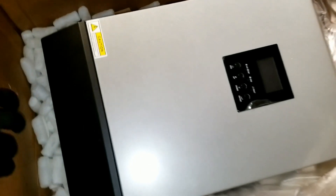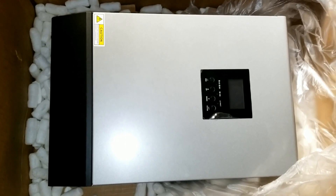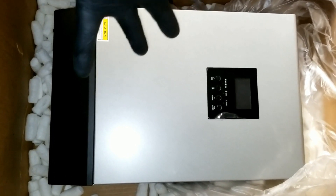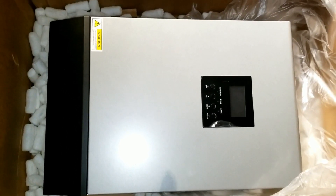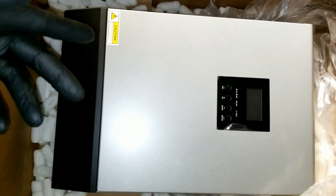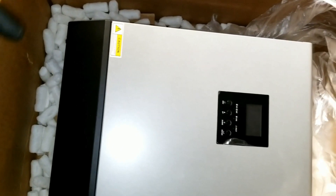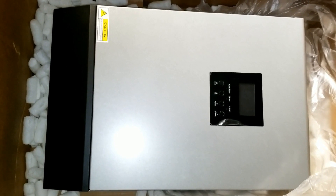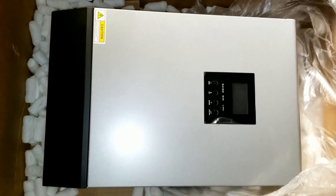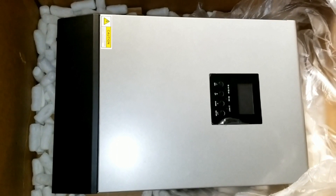JW Solar USA live in Minnesota — thanks for watching, love you guys all. I'll power this thing up on the weekend and we can see from there. It's a 230-volt international unit, not for the US — you'd have to use a step-down transformer, which doesn't make sense because you lose efficiency. I'm not recommending using a transformer; buy the US version. It's only 230V and has mostly been used in Australia and other parts of the world. Stay tuned, see you guys in the next video — bye for now.